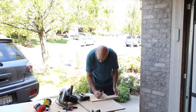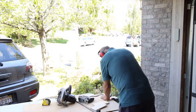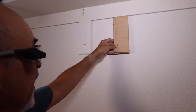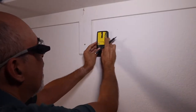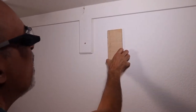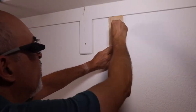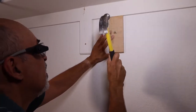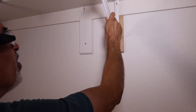I've just got to make another one now. So all I've got to do is find the stud where this is going to go and put this thing up. This is a stud finder. Those are the edges of the stud. I'll line that up and center it — so that should be centered. I'm just going to put one nail each in the center here to tack this down.